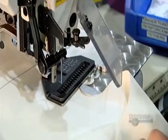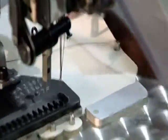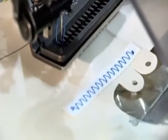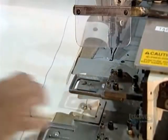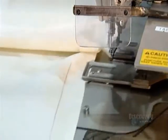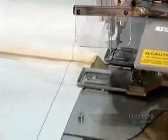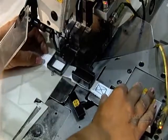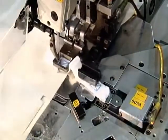Although the airbags have been seamlessly woven, attachments and reinforcements still need to be sewn on. The stitching is computer-controlled — a worker feeds the fabric to the sewing machine and then simply presses a button. The machine stitches together the tabs that will connect the airbag to the inside of the vehicle frame, just above the side window. Here, it sews a tether onto the bag — a strip of fabric that will also be used to hold the airbag in place.